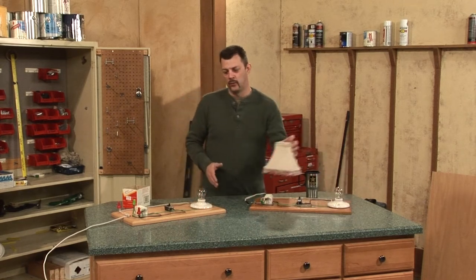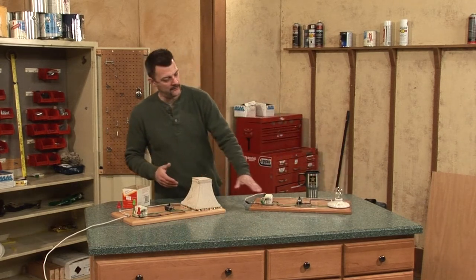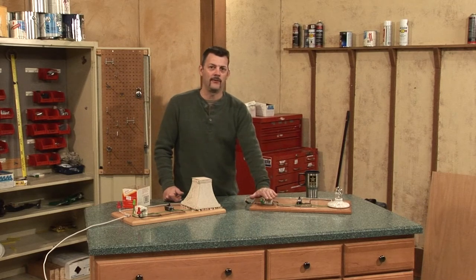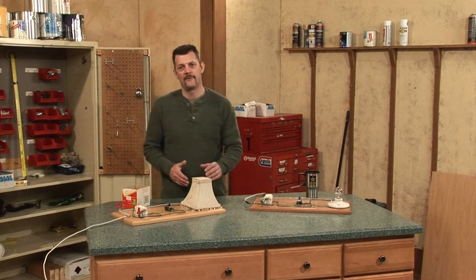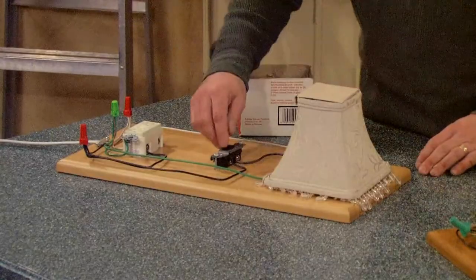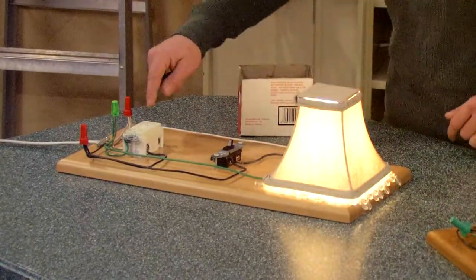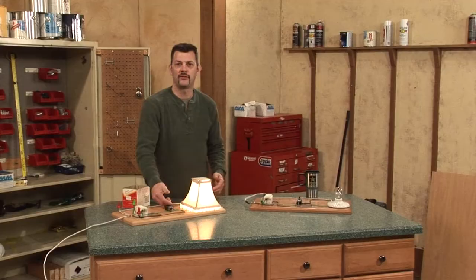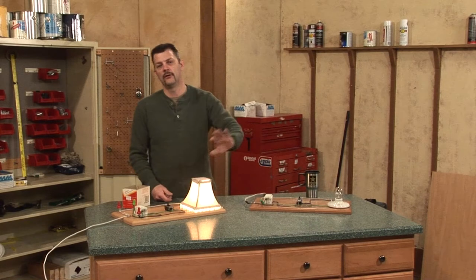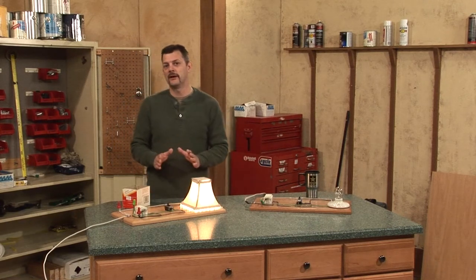Now it all is in the wiring. And instead of daisy chaining the power off of this GFI receptacle, if you add pigtails instead, you're not going to have this problem. So let's take a look at it. Our light works. If I trip the GFI receptacle, nothing happens — we still have power to our light or receptacles in line. And that's because of the pigtails.